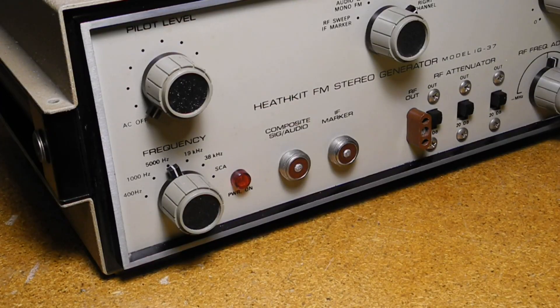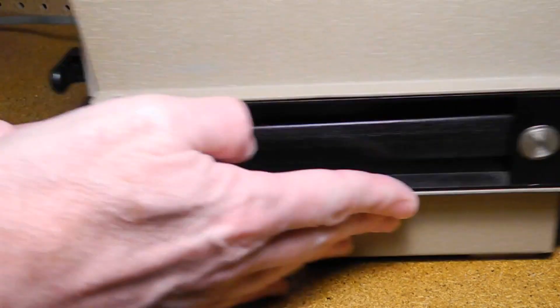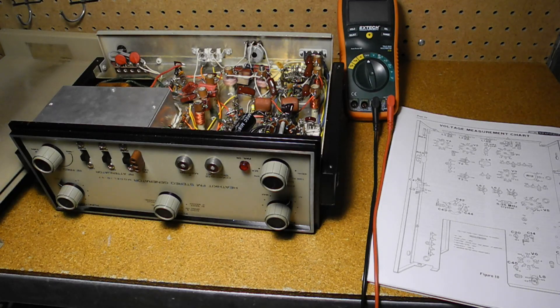The unit has the original microphone style connectors. The screw near one of the handles is not original, and it didn't include the original 300 ohm test leads, but everything else is complete and original. I first did some basic checks of resistance, then carefully powered the unit up, confirmed that all tubes lit up, and made voltage measurements as per the manual. It appeared to be basically working.